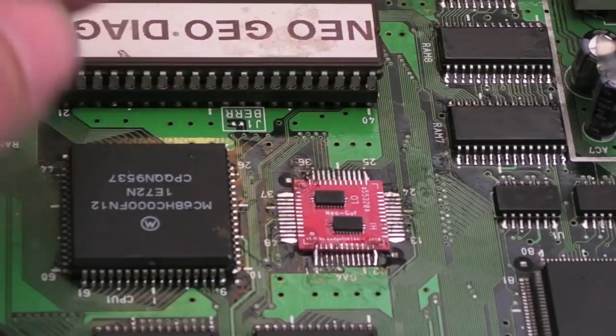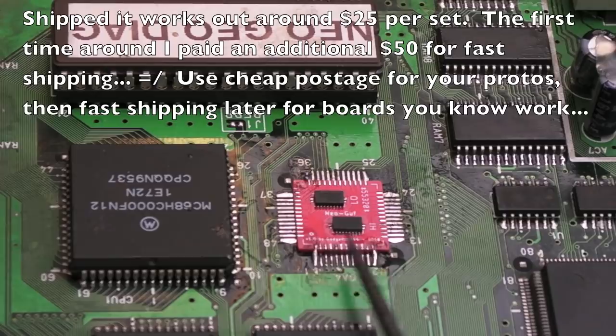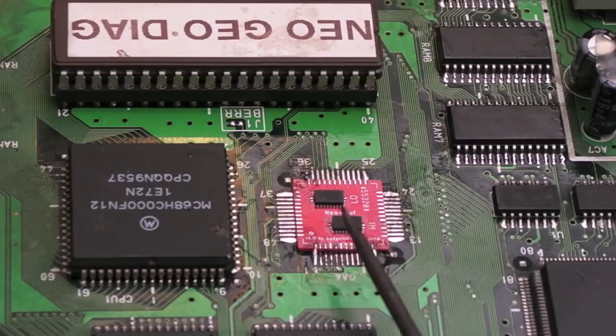So I'm going to do a revision. They're only cheap, these. It's like $15 or something to prototype this. So I'll order some more, but it is going to be a couple of weeks at least waiting for the new ones to come. And I think the revision I'm going to do, actually, I suspect if I'd castellated the edges, Dirty PCBs would do the same thing they've done to me with this, where they trim it with a distance of the PCB still there between the pad and the edge of the PCB. And I don't want to be dremeling every single one of these down. So I actually think the PCB size as it was is okay, with the exception, obviously, you can't join the pads up.